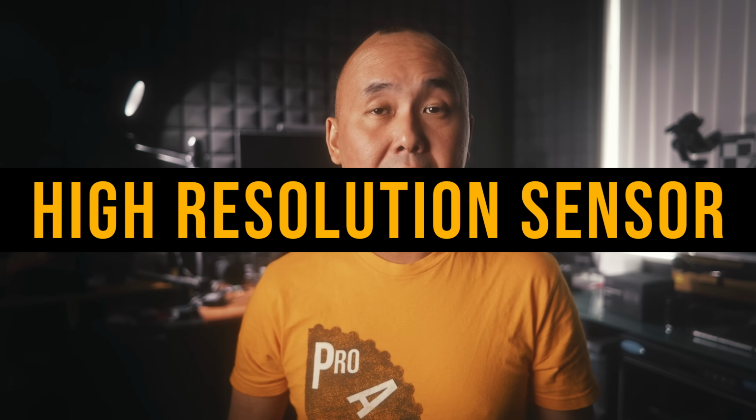Another big upgrade that comes with the X-T50 is the 40 megapixel sensor that we have previously seen on the flagship X-T5 and X-H2. As I have an X-H2 myself, I really like this sensor, but some people may have concerns about the high resolution output. The first common concern is, would the low light performance be worse than the previous 26 megapixel sensor? Because usually a high resolution sensor means poor high ISO performance.